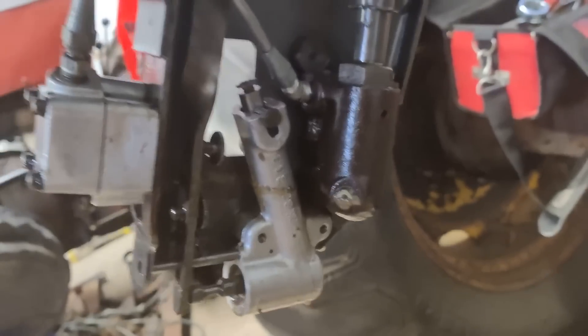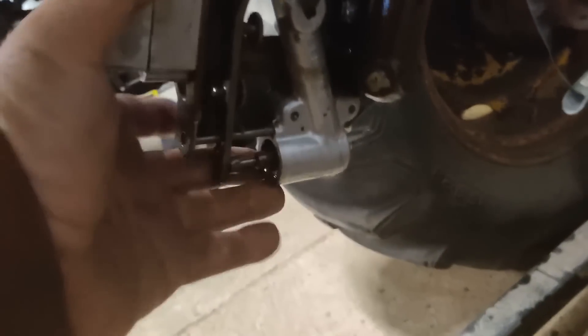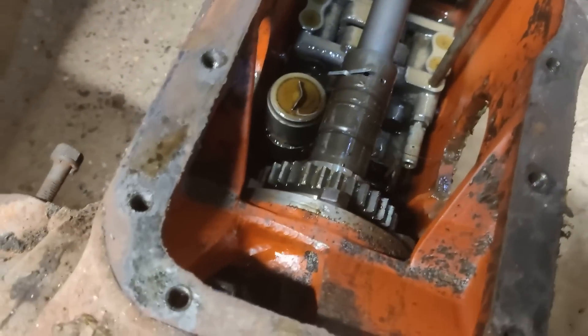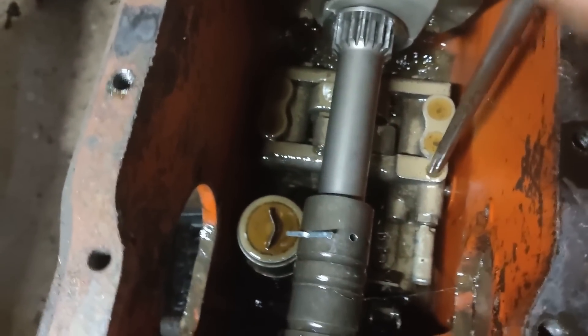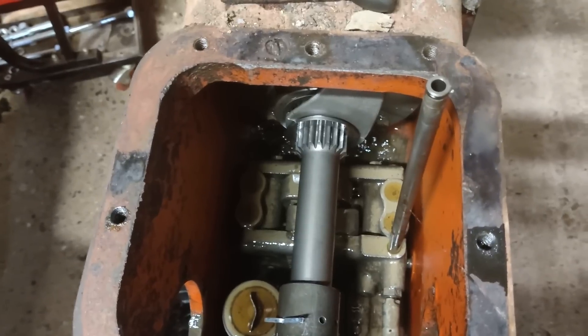Let's have a quick look under here — it actually doesn't look bad. So there's your pressure control diaphragm, there's your pressure control valve, your dashpot here. If you remember from the Hydraulic Horrors videos, there's your dashpot, there's your pressure control valve and the linkage for it. By the way, that is called a standpipe, not a stackpipe — it's a standpipe. So if anyone calls it a stackpipe, you have my permission to punch them in the throat and tell them it's a standpipe.